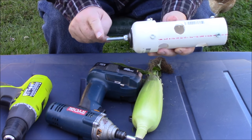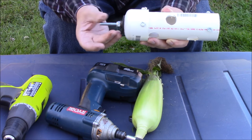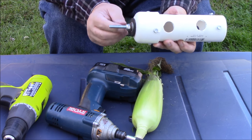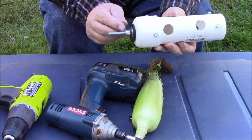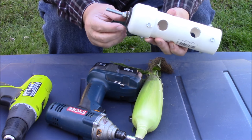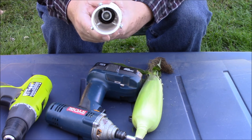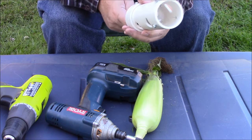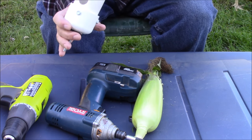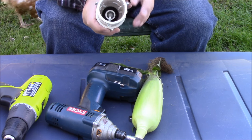What we have here is a three-inch carriage bolt, a self-locking nut — it has a nylon bushing on the inside so it locks itself instead of backing out. Then we have a couple of washers of various different sizes. Basically what you're trying to do is sandwich this piece of rubber — it's a thick heavy rubber washer you can get at a hardware store — and I also have a rubber washer on the inside with a flat washer. The reason you use rubber is that if you put metal against plastic and work it back and forth, you're going to crack it after a while. So you put your carriage bolt, washer, and rubber on first, making sure the rubber is attached last.